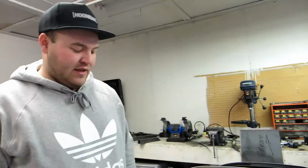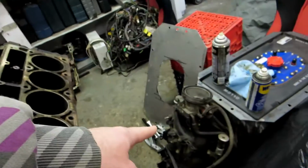I'm gonna have to get a new crank because if you know anything about 99 to 2000 LQ4 cranks, they're 0.4 of an inch longer, and that makes it not able to mate to any fun transmissions aside from a heavy-duty automatic 5-speed or 6-speed. That's a no-no. So I'm gonna have to get a new crank, which means I'm gonna have to rebalance it, which means I might as well just buy new rods and heads and pistons, and we'll see where that goes. It's just going full out, and also a new intake manifold because that one's too big. I think this will work a lot better than the rotary. Yeah. And it'll be more fun.